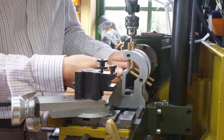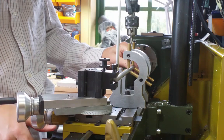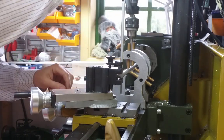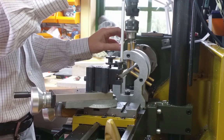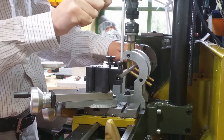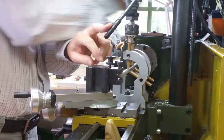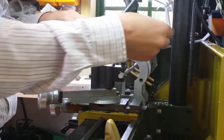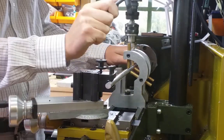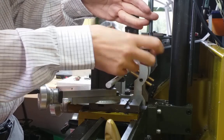After I have drilled the first hole, I put in an aluminum piece inside it so I can align it for the second hole. This is needed, but in the rest of the holes this will not be required because the slider will hold the aluminum piece at a fixed position. I need to move the slider back and forth and make a new grip because my lathe is quite short in its bench.